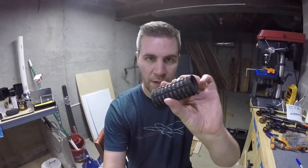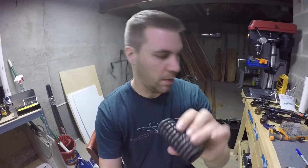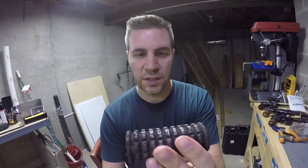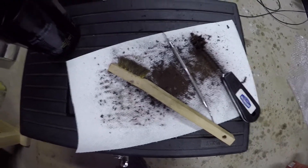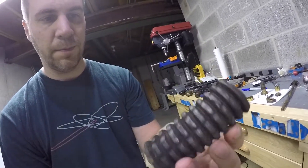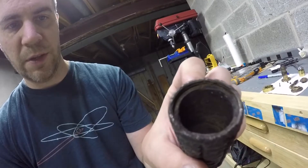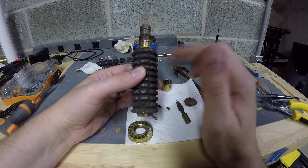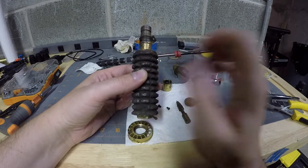I just pulled the frag body out of its second round of electrolysis and did a round of picking, just clearing all the gunk away from the little crevices, which is quite a mess - there's a lot of it. Trying to get that free and clear. The bottom's pretty eaten up but you can actually thread things on there just fine, and so is the top - the top's in a little bit better shape. What I need to do now is give it a rub down with steel wool, wash it off, and then blue it, rub it again, blue it again, and then give a coating of oil.